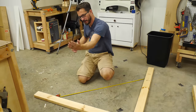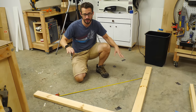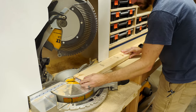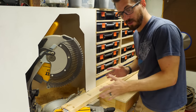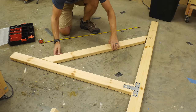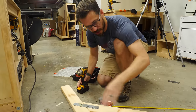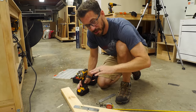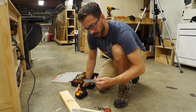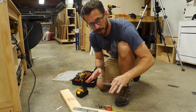There's gonna be a lot of force going back and forth on this thing, so we're gonna put in a diagonal here and one there just to reinforce it. I'm just using these tie straps to kind of put everything together because it's strong and it's quick. I'm gonna take the off-cut from that centerpiece and put a 45-degree angle on each end of it so it should fit right in there. These tie straps are often used in construction or making decks — they're quick and strong and should work pretty well for this particular use.